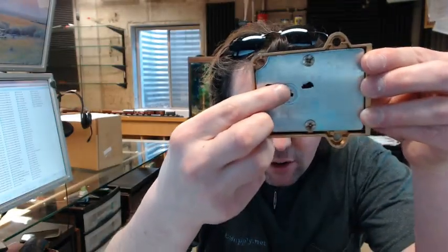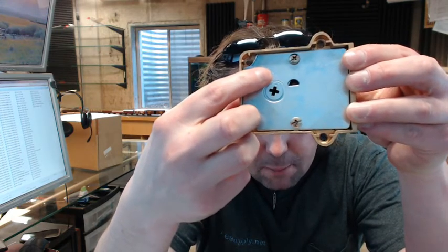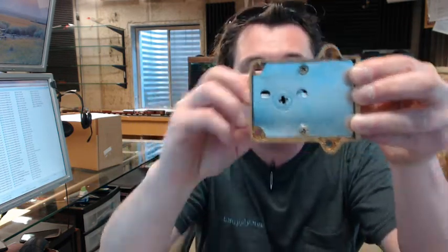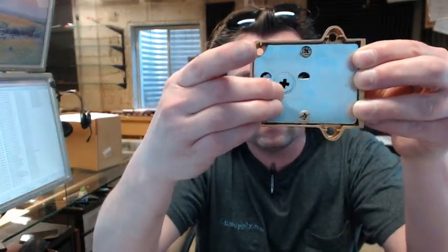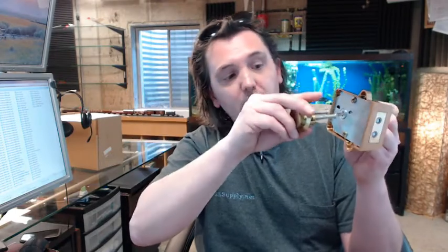At that point you are at step 4. Turn the cam to the position as illustrated — there is a small mark at the top of the cam that they are indicating, and there is a little arrow right at the very tip of my finger. Line those up, and at that point you should be in good shape with the installation. Get it like that and you will be in good shape because the timing of the tail piece will be correct when you put the lock body onto the back side of the tail piece.